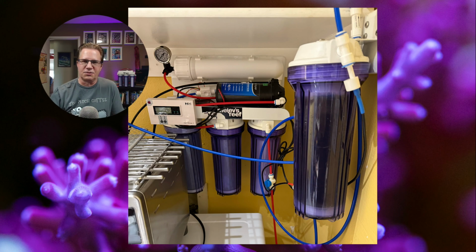Some people do have separate cation and anion instead of a mixed bed resin like I sell. And so the first one would be cation and the second one is anion, or vice versa. I don't think it matters. And one will get used up more than the other. I know that. And you might end up changing anion many, many times while the cation seems to last forever. But I've never run a separate system. I've always run a mixed bed, and it just does what I need. And my life is simple, and I don't have to have a lot of stuff in my utility room. I just have this.